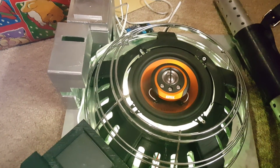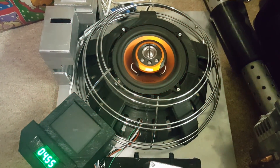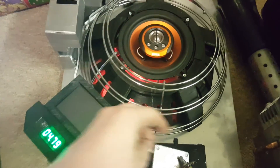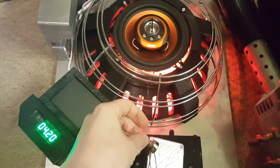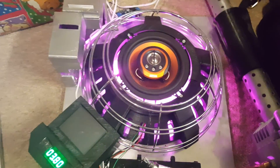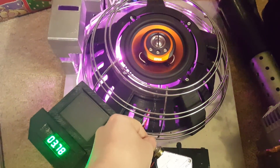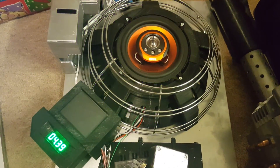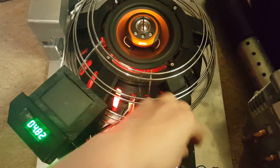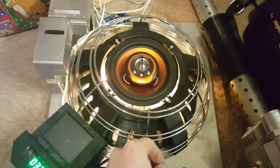See if I can get some more yellow by turning up the green. With a little bit more tweaking I've now got it displaying the correct animation but for some reason there's a gap at the end of every pulse. If I want to change the colour I have to wait between rotations to see what colour changed. If I put the blue one up at the start of a rotation it won't take effect until the rotation is finished. That's just standard with the way NeoPixels work — whilst they're doing an animation you can't really interact with anything on an Arduino board — but at least we now have infinite amounts of possibilities with colours. You can see we're getting an orange colour now and as the green kicks in again it's going more towards yellow.